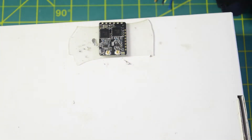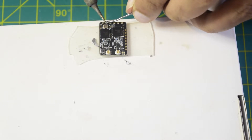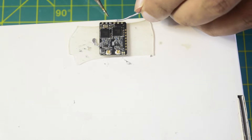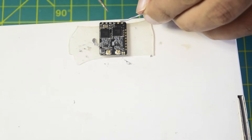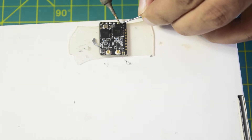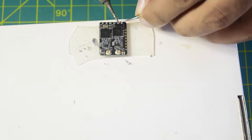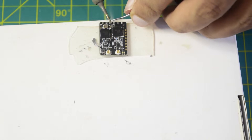This is my radio receiver. Let's tin the ports I'm going to use. First one is ground, then 5V. Then the TX port goes to RX, and the RX port goes to TX — this is for your radio controls. Then for Mavlink, again TX goes to RX and RX goes to TX. That is how we are going to connect all the ports.